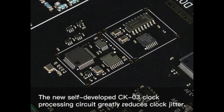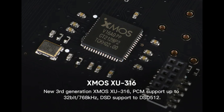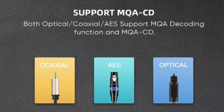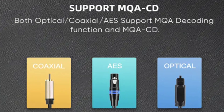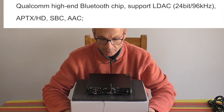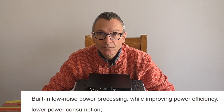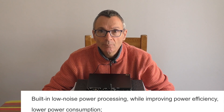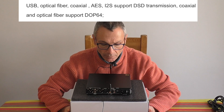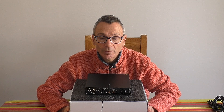I'm not going to unscrew it for you, but I can tell you that apart from the flagship DAC chip — of which there's just a single DAC chip — you have 11 op-amps for the analog output stage. The analog output stage is of course what we can hear; without it all we get is zeros and ones. This is what differentiates the sound from your smartphone — which also has a DAC chip — to something like this, which has a much bigger circuit board, a much bigger analog output, and a digital input interface. You'll also get support for higher transmission rates on the digital inputs.